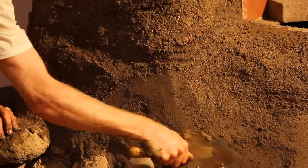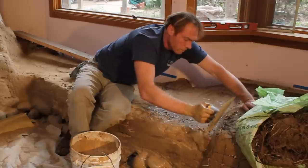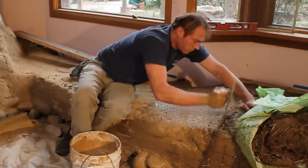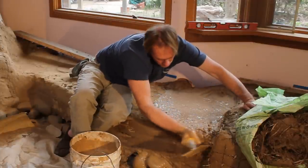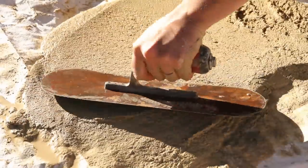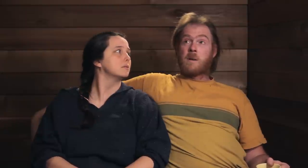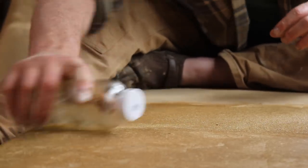There's a whole set of masonry tools — the square brick trowel, a cement float which has a ragged edge on one end that you can use to make a rough surface on the plaster, and then steel floats and wood floats for finishing where you're going for certain textures. A wet steel float is really good for a final smooth finish. I have a tendency to grab glass bottles and smooth down cob with them. Don't use a glass bottle you like.